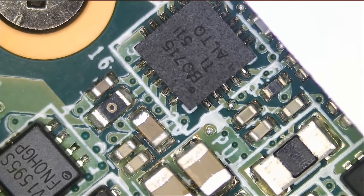Do we still have a short? The short is gone. So the IC is what's causing the short. Let me test here also — we still have a short on this cap. So now with this IC out, I'm going to inject voltage on this cap and see what gets hot on the board now.